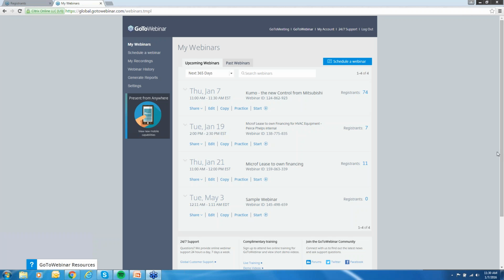Let's see if we have any other questions. Can we use the Kumo Cloud instead of Honeywell's app for an MHK1? The answer is no. The MHK1 is only compatible with Honeywell's RedLink technology. Kumo Cloud is proprietary software compatible only with the Wi-Fi interface. You cannot combine the two.